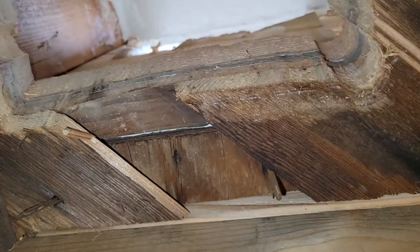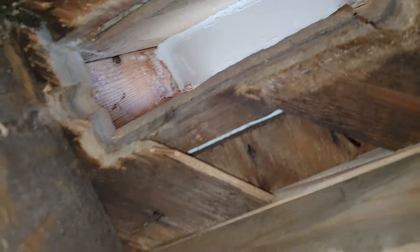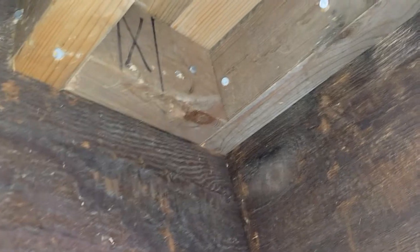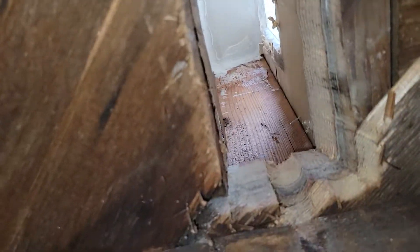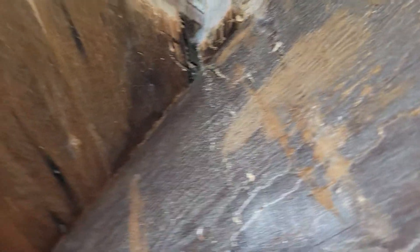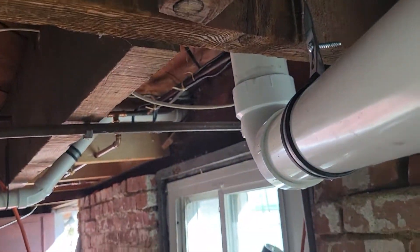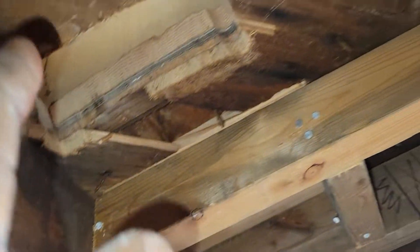So you want to see a shot from down here — there's the hole. The idea is I'm going to wipe down and paint this area. I'm actually going to use a membrane, the stuff we use for shower pans, to make it airtight. You can see the baffle up there — it can't go up the wall, it doesn't have to be neat. We're just making a hole through, and I think the easiest way to do this is to block this area off.